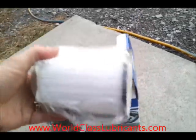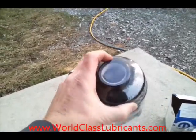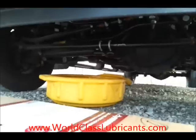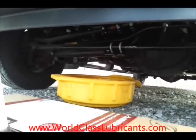This is the one up front for the engine, and the one in the back by the rear axle is actually a fuel filter and water separator. First thing to do is place a drip pan underneath the truck — place it underneath where the drain line for your fuel filter is, so you can catch all the fuel that comes out.